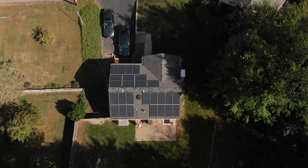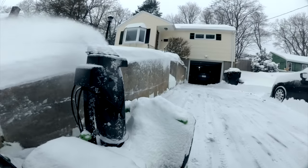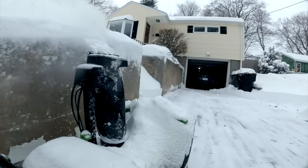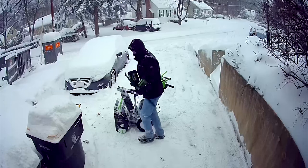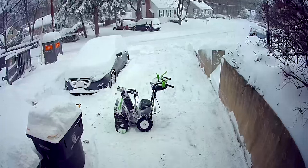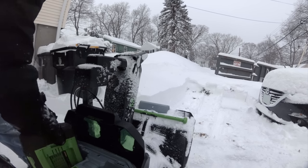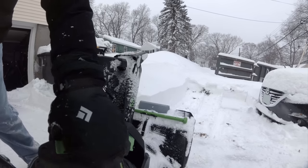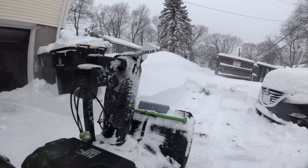But there's the battery life. For a sense of size, my house has a single car garage, but a driveway that's double width for a second car parked outside. At its widest, it's about 16.5 feet wide and 42 feet long — taking all the variations in the shape, the driveway is about 630 square feet or 58.5 square meters. I almost completed snow blowing when the two batteries gave out. Since I already had other batteries available from my mower, my leaf blower, and my edger, I just grabbed two 5Ah batteries, swapped them out, and finished up. I only needed about another 5 minutes to complete the job. If I had kept the auger powered down in the upper portion of the driveway, I probably would have had enough extra power to use at the end of the driveway on a single charge.